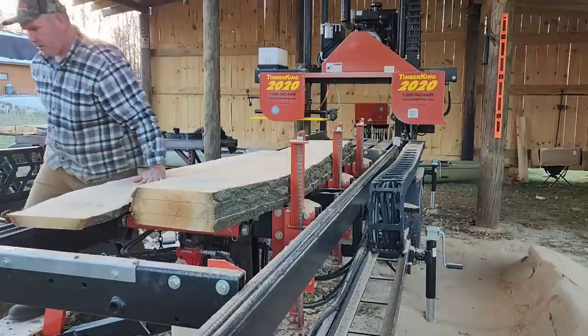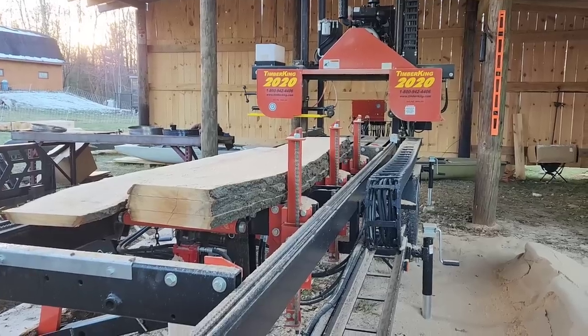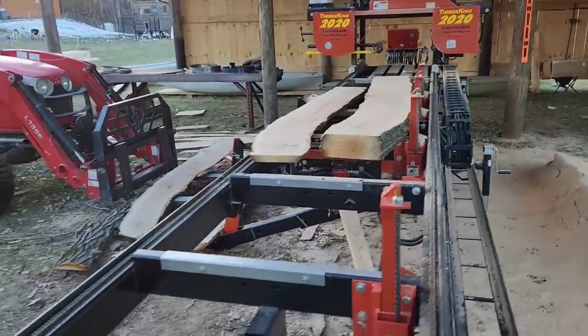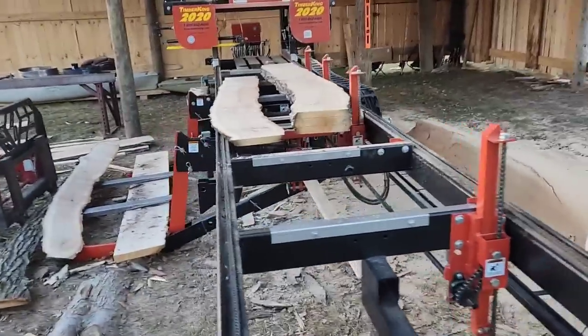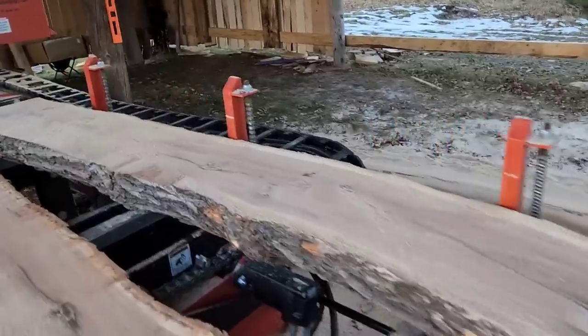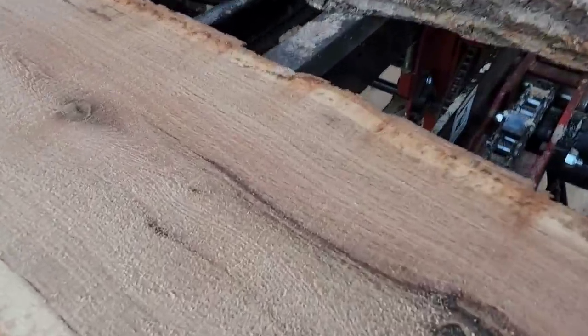Alright. Camera over here, and then I gotta do some square footage calculation and convert that over to board footage, not taking consideration the thickness. Again, the square footage is if everything was in 1-inch material, the board footage is the actual volumetric measurement of the wood. So take a look at that.